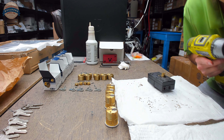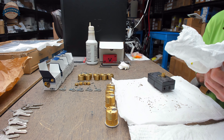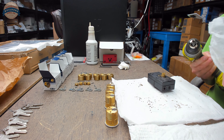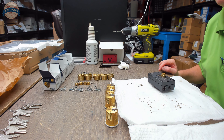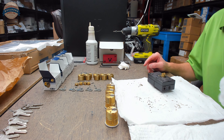Those were the door types that they had: the D and the VMAX — there was no other door. Kewanee also did hollow metal frames. They had the masonry F-series, and you can guess — that's masonry. An F-416 would be a 16-gauge typical frame.